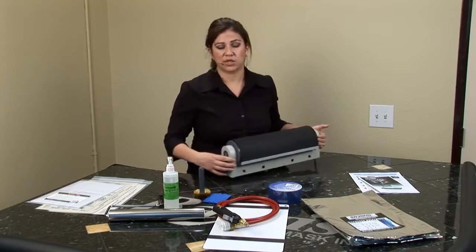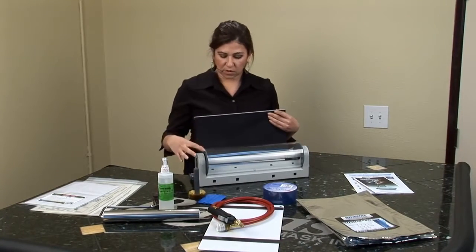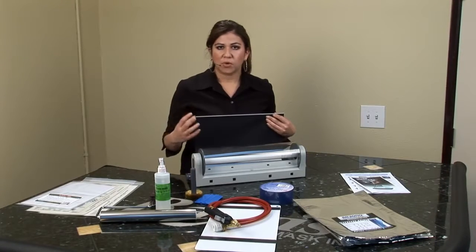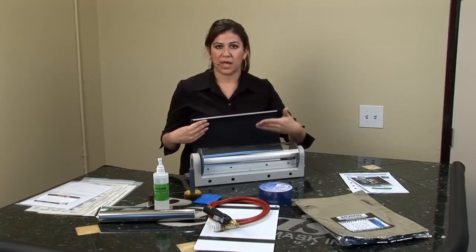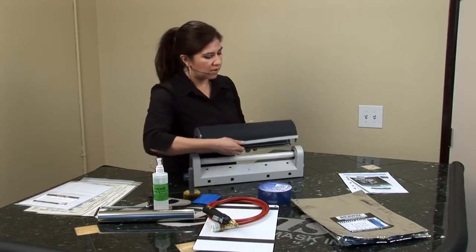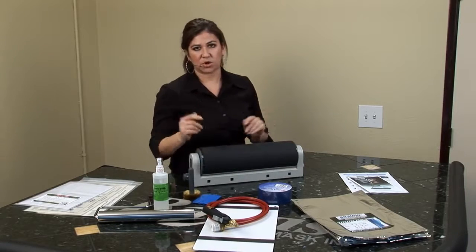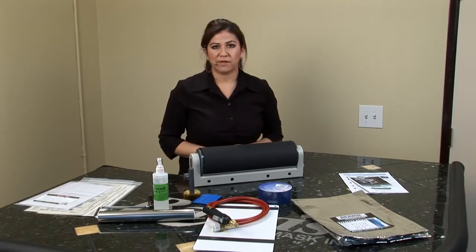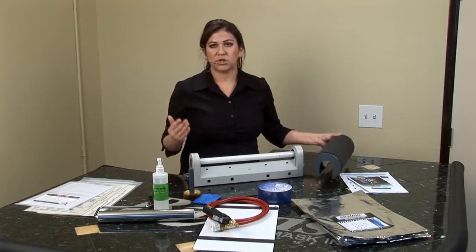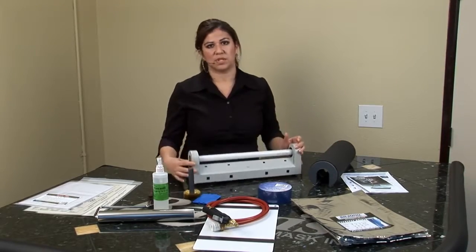Lastly we have our exposure unit — just a UV exposure unit. It has an exposure blanket, and the bulb is a UV bulb. It sits 3 inches from the cylinder so you have proper exposure distance of your photomask and the print film. The blanket clicks to the end and secures nicely so you don't have to worry about any movement between your mask and your artwork during exposure. You want to expose for 25 seconds. Another use for the unit: you can remove the cylinder and use it for UV gluing — if you need to cure UV glue, you need a UV light to cure it, and that's what this can be used for.